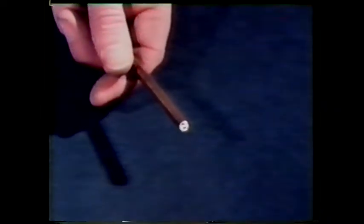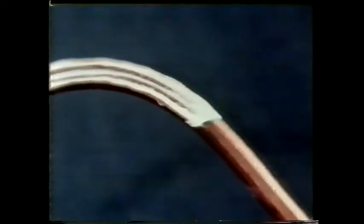We use magnesium oxide as an insulator in these cables. The oxide — or mineral as it's generally called — is compressed around solid conductors which are enclosed in a metal tube. This type of cable is known as mineral insulated cable. When the cable is bent, the mineral continues to keep the conductors apart. This type of cable also provides its own mechanical protection.